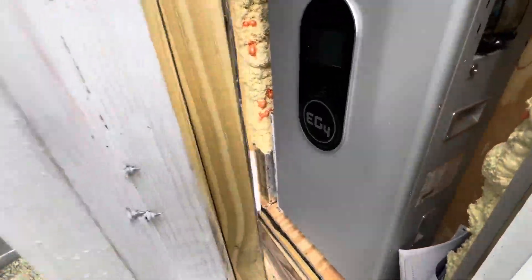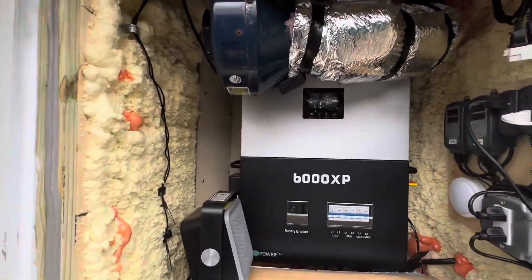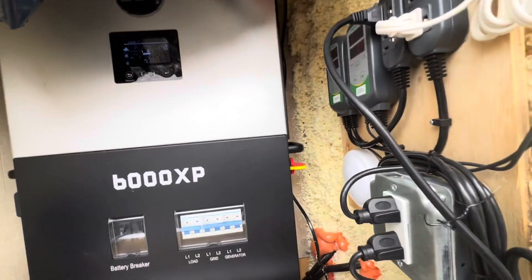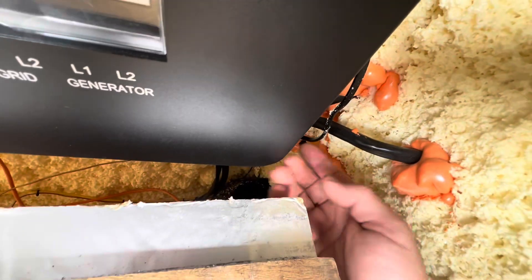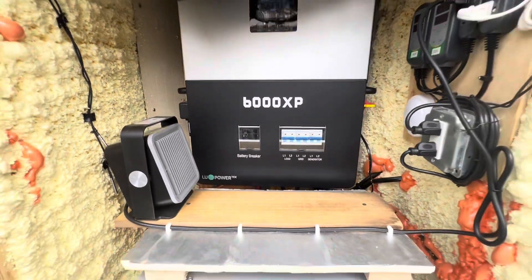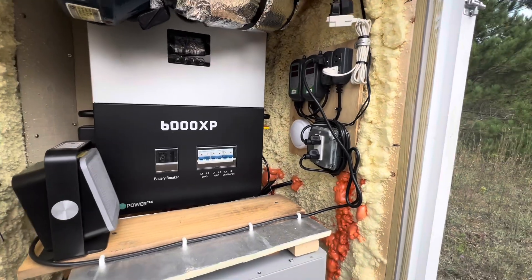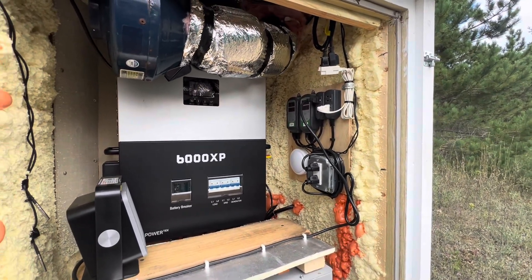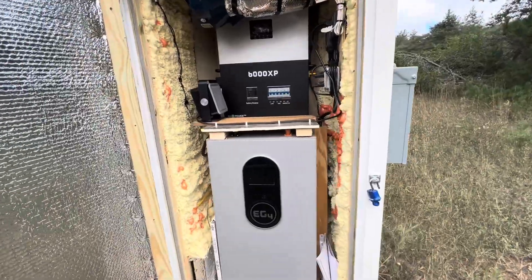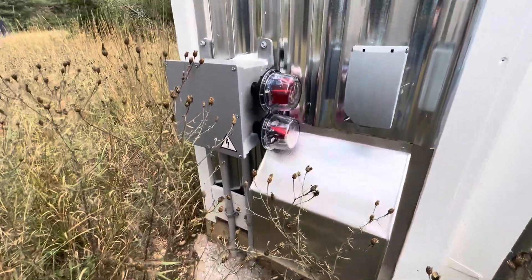We tried to solve a lot of problems — how to put this thing in and not choke it. It's pulling air where the exhaust of the inverter is right here, so it kicks here and it sucks right out. The intake is right here and you can see the air intake comes straight up here, travels up like an invisible pipe and feeds. It seems to work great. This thing has survived a harsh Michigan winter. Actually, that ice storm that hit up here in the Petoskey area — this thing had power when everybody else didn't. Just used a roofing vent for the air intake, and put some Midnight Solar surge arresters.